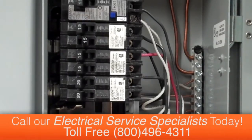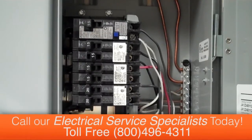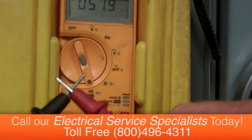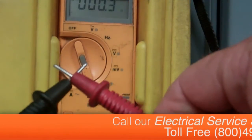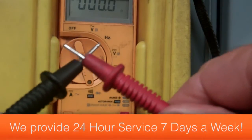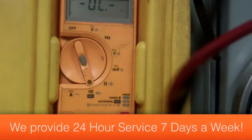What we want to do is use our multimeter and put it so we can pick up a tone and check continuity. Let's make sure our test leads are good — we'll test them, and you can see by bringing the test leads together the display reads 0.0, showing a perfect connection. My test leads and battery are good.